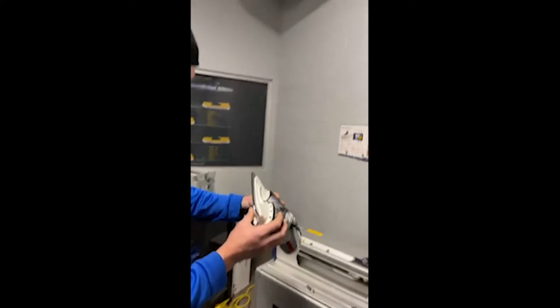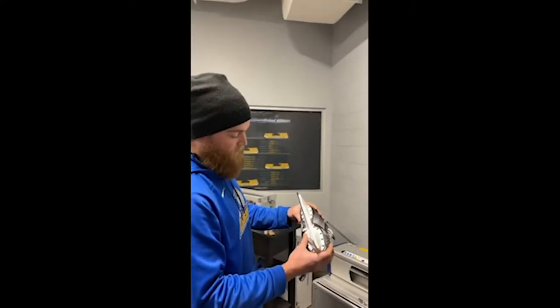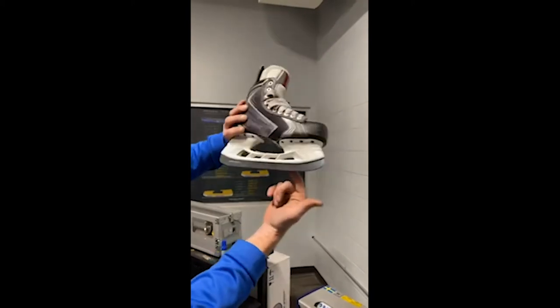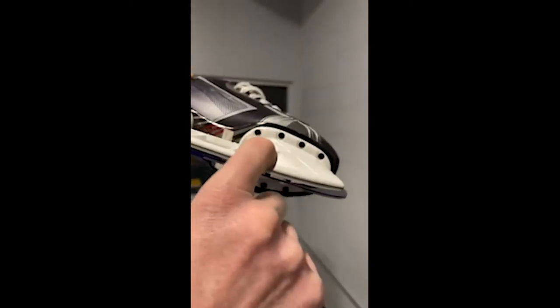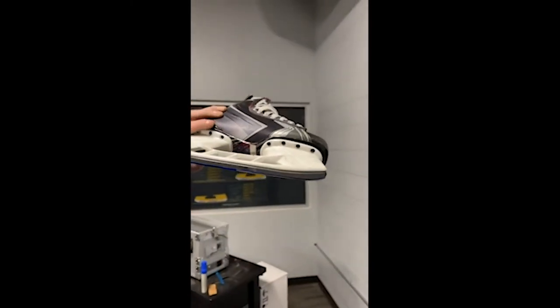This one's not even touching both sides of the blade, which is pretty severe in terms of being off. My gut feeling is it's probably four to five clicks off to get it corrected. What's happening is the grinding wheel is grinding too far on one side of the blade — I need to get the grinding wheel to grind more on the other side, so the actual grinding wheel needs to come out of the machine.